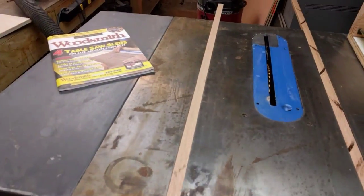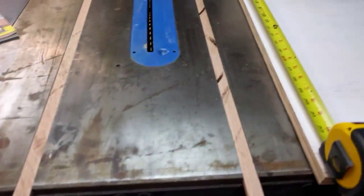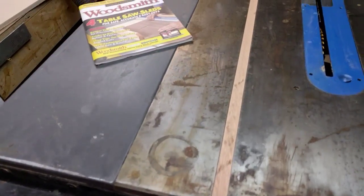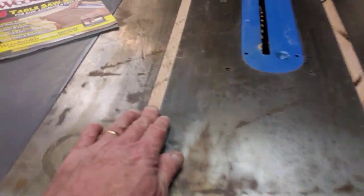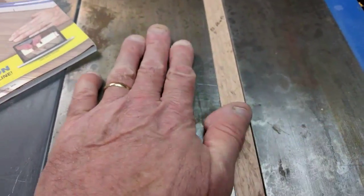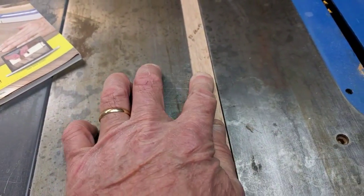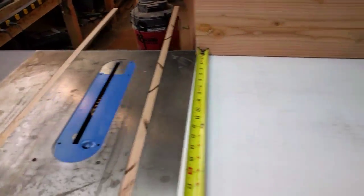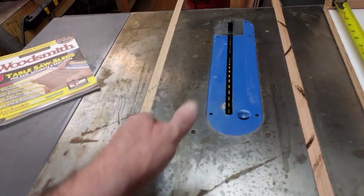I can lock it down on the board when I put it there — that'll be cool. You need strips of some kind of hardwood; this is oak as well. They go down into your table saw slots, and you want them to be shallow, shy of the top of the table.